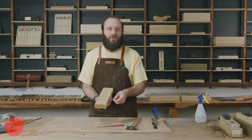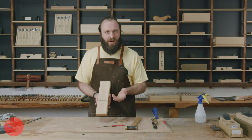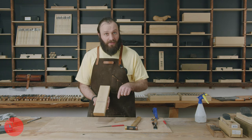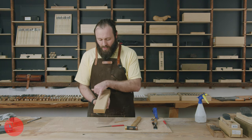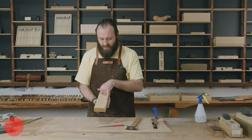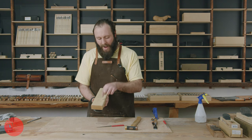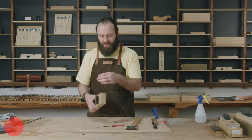That's now moved a good three millimeters down — I've got past a small choke point. But as I drop this blade, I want to make sure that it is dropping square. If I drop this blade with one side protruding further than the other, it's going to be very hard to adjust it to get a nice even cut. At the moment one side of my blade is moving faster than the other — I'm closer to protruding on one side and further away on the other. What that might mean is that on the side further away I might have a high patch restricting the blade, but I think more likely I've got something happening in the channels that's stopping it from evening out as it drops.